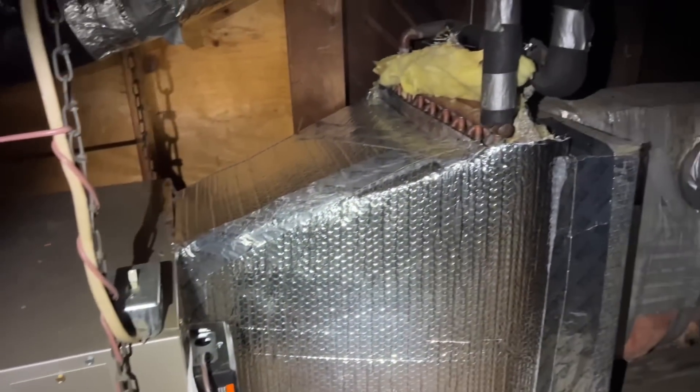Here's the air handler — no water in the condensate, everything else is normal. There's a little funky smell but everything else is good. I had all my money on an electrical issue with the circuit breaker, through no fault of equipment or installation. I had no idea we were looking at a seized-up contactor on the condenser. We're going to submit a warranty claim through Carrier — I'll get back maybe a $20 or $9 contactor.